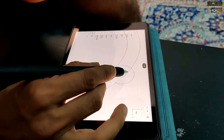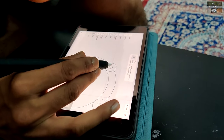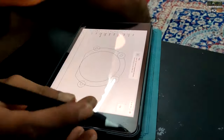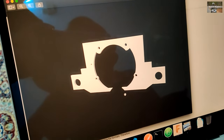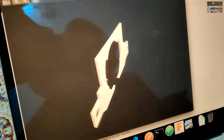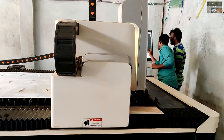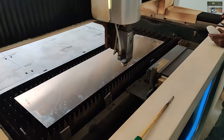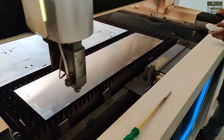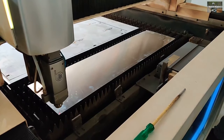Then came converting the hard copy design into a soft copy to be taken for laser or plasma cutting. We got help from people accustomed with AutoCAD — big thank you to Santosh and Arun Kumar. We took the design to the laser/plasma cutting guys and had it cut into a 1mm aluminum sheet, chosen because it would be sufficient for the load and for bending into shapes.